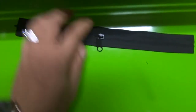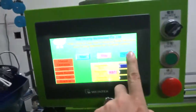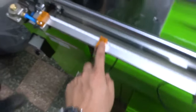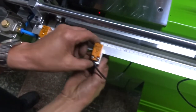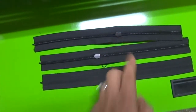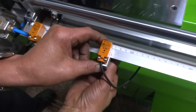The slider is currently in the center, which is okay for this reverse zipper. If we move the sensor to the right side and run one cycle, you will see the slider moves to the left side. And if we move the sensor to the left side and press one cycle, the slider comes to the right side. So the sensor position controls where the slider lands. We set the sensor to a standard position and you can adjust it to fine-tune the slider position.